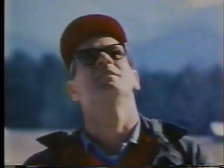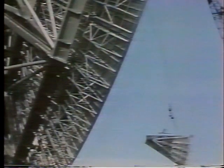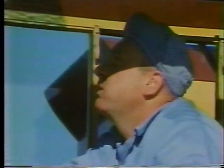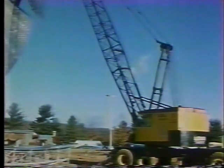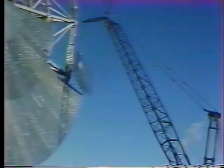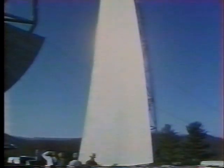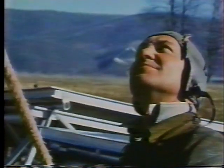Each of these assemblies was trucked over 750 miles from the fabricator's shop. Some were bumped, bent and strained in transit and during handling on site. But instrument checks demonstrate that they have satisfactory compliance. Each element can take over 1/2 inch of differential deflection among its 4 supports and will return to its paraboloidal shape. No deflections are expected in excess of 3/8 of an inch in winds up to 135 miles per hour.